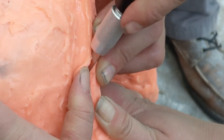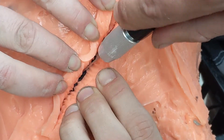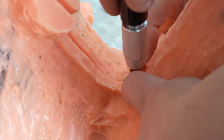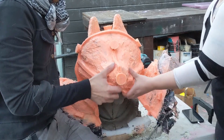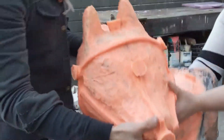Using a curved blade is important because as you pry open the seam and do multiple passes, the curved blade moves around your previous bumps and valleys — whereas a straight X-Acto blade would cut right through them and destroy the keys. The hardest part about this technique is spreading open your mold as you cut. You can buy mold spreaders, which are like reverse pliers that pry your mold open as you go. But for the kind of mold I'm doing, it's pretty much a requirement that I have a second set of hands. This takes a while to master — I recommend practicing on smaller scrap pieces of silicone first. For this mold, I'm cutting a seam along the back and directly under the chin. Once that's all properly cut, it demolds just like a glove, and the clay sculpture underneath is 98% intact.